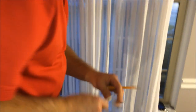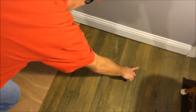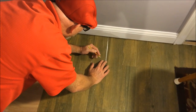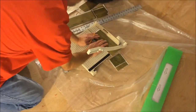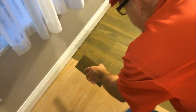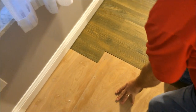We're going to do one more cut. On the arrow side up this time, I know this is a factory edge because of the paper. If I go back two planks, I'm matching this line right here — the same as that line and so forth. This is going to lay this way, so I reverse it and go back to this plank, sneaking just under the baseboard. Not much to cut here. And I'm ready to begin a new row — so you get the idea. It just repeats all the way through to keep the pattern the same so that the lines are the same planks every third tile all the way through the house.